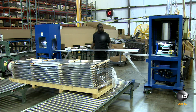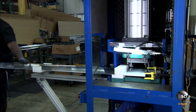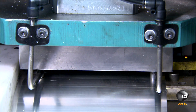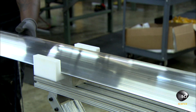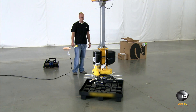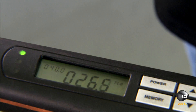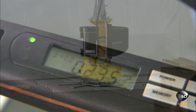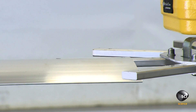To make an industrial ceiling fan, they use long aluminum airfoils whose wing-like profile generates lift to produce more air movement. A punch cuts holes to assemble them to a hub. A worker attaches the main fan assembly to the end of a long post to facilitate installation of the long airfoils, then slides the airfoils onto spars that protrude from the hub.